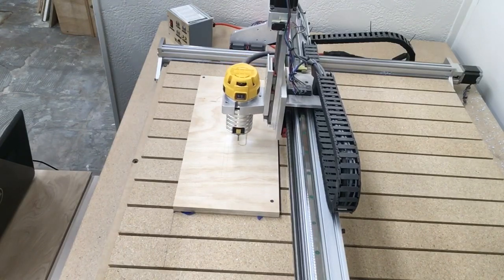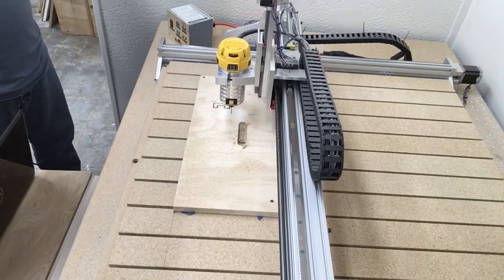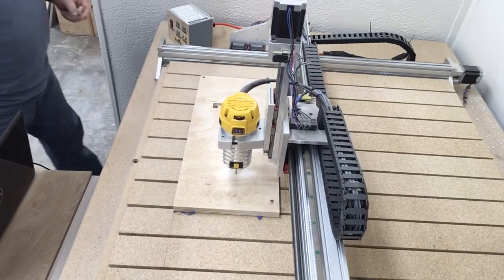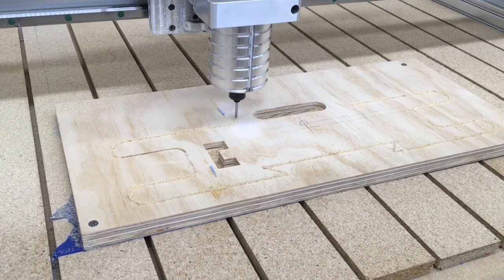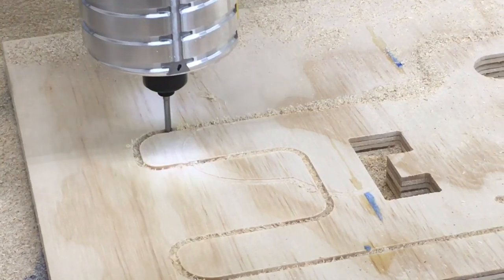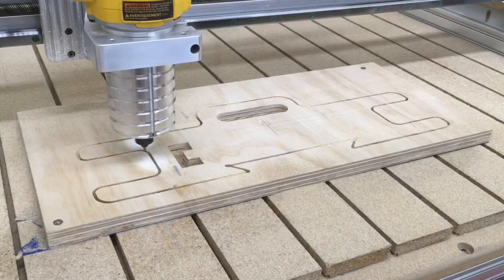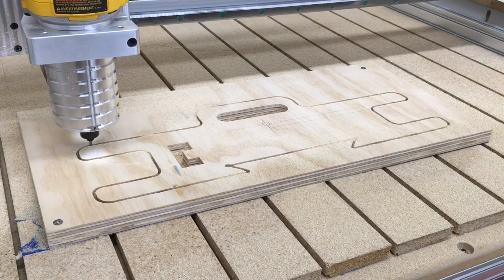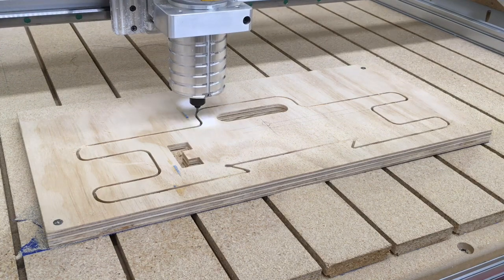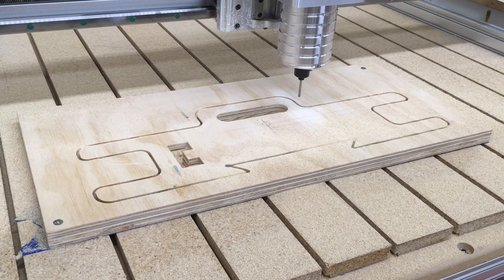I really wish I had remembered to move the XY zero point to the bottom left corner, but it's going to work just fine. You can see it's starting to make those inside cuts first. With that done it moves directly to cut the outside. I saved both tool paths on the same file because it was the exact same bit, and that really does make it easier. I have shown in other videos where that was not possible and I used multiple bits. This is a very effective way to carve these different types of tools, jigs, and shop accessories. I hope you find this video very helpful — please like, subscribe, and share to get these recommendations out to everyone in the CNC world and the woodworking community.